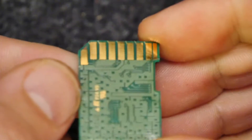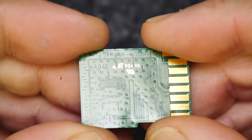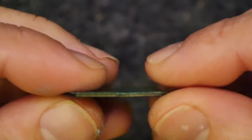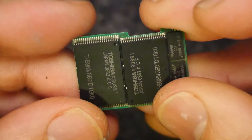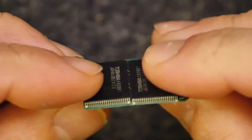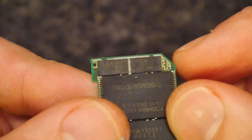Just inspecting this region here in case it was just dirty tracks all along — they were a bit filthy but I really doubt that's it. There's a P24 V0 PCB marking. It's really thin — I don't have a micrometer with me, but it's a pretty thin PCB. You can see actually how easily these things could be damaged if you ever flex the SD card. Flexing it one way is probably okay, but flexing it sideways you risk popping the flash pins on the edge.